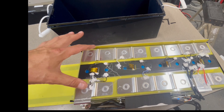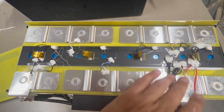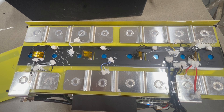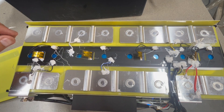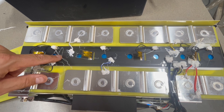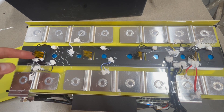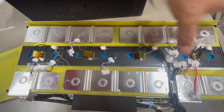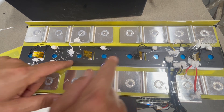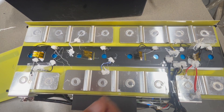They actually have an insulated shield in between the bus bars that are laser welded onto the cells. The wire management is pretty slick — everything is clean and comes off of the board, with all leads insulated. These are bendable, so as it slid into the case they just compress down. Everything is glued up with white sealant. I think these are the leads to the heating pads themselves — four different ones that run in between the cells. I've never seen anyone else do it that way. You have very short wire runs to the board and then a fairly short lead going from there to the BMS.